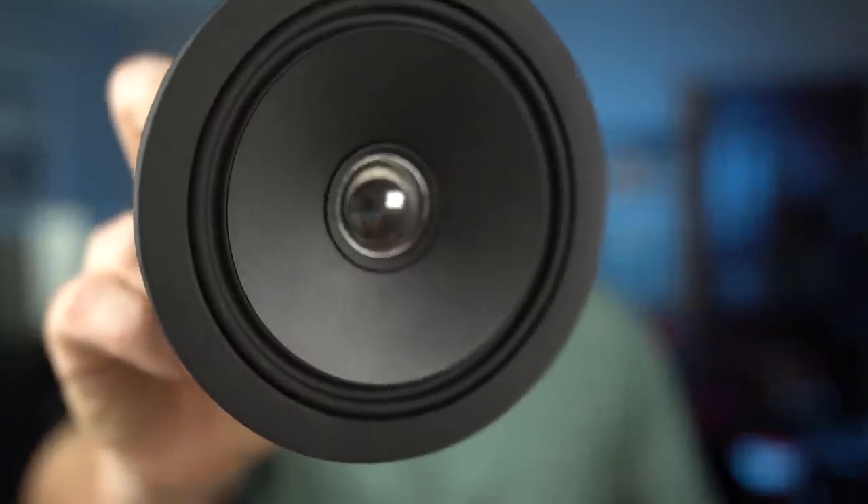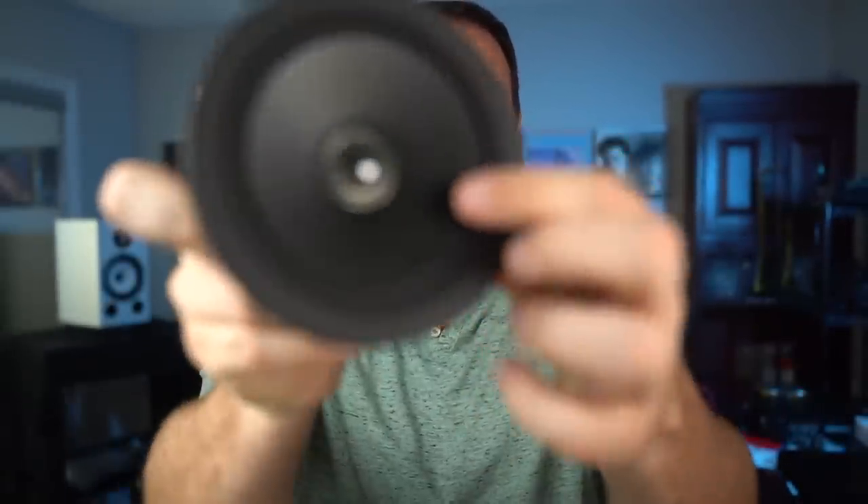Just look at it. It's a little four-and-a-half-inch coaxial coincident driver. You can see a little tweeter in the housing, and they did a really good job on this tweeter connecting to the mid-range, because every coaxial speaker the mid-range acts as a wave guide. A lot of times you'll see cheaper coaxial speakers where the tweeter is mounted out in front of the mid-range. When the tweeter is mounted inside the mid-range like this, that usually indicates it's going to be a good design, and in this case it is a pretty darn good design. The tweeter has a housing around it that merges well to the cone profile of the mid-range, and the mid-range doesn't really have any large surround — it's a smooth, nice step to the surround, which also helps the frequency response.